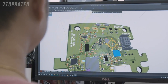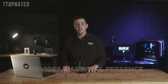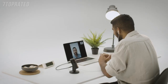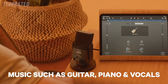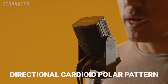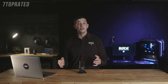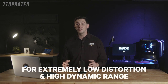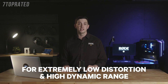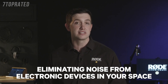Like all of our microphones, this starts with the capsule and the electronics. The high-quality condenser capsule in the NT-USB Mini has been tailored specifically to provide warmth and presence in your audio, meaning that it sounds amazing for capturing dialogue, but it also sounds great for music applications such as guitar, piano, or vocals. It uses a directional cardioid polar pattern that's been optimised to pick up less of your room noise and more of what's directly in front of the microphone. The NT-USB Mini also features studio-quality 24-bit 48kHz analogue-to-digital conversion, providing extremely low distortion and very high dynamic range. It has also been designed to be highly immune to RF interference from other electronic devices in your recording space.